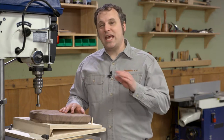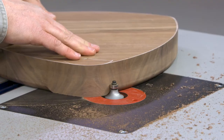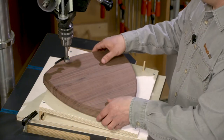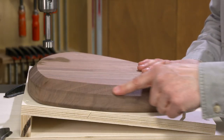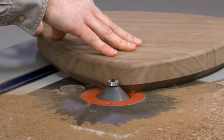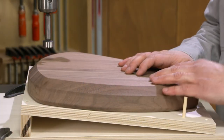Then I wanted to add a few details. On the top edge of the seat, I added a 3/8 inch roundover - that softens the edge just enough so it's not going to cut into your legs when you're sitting on the stool. On the bottom face of the seat, I routed a pretty hefty chamfer. What that does is lighten the overall look of the seat without taking away any of its thickness, because we want those legs to anchor in a nice thick seat.